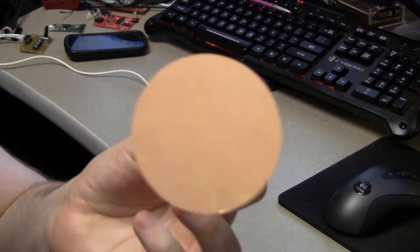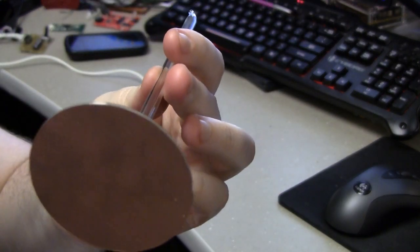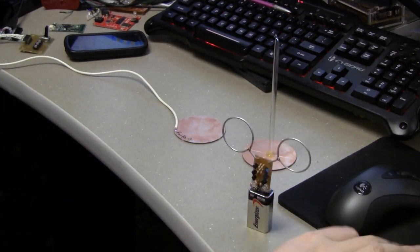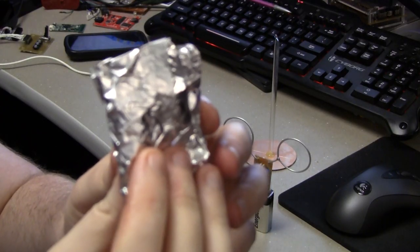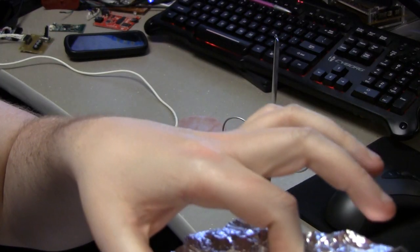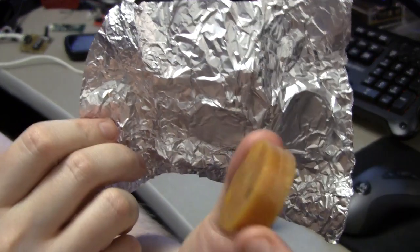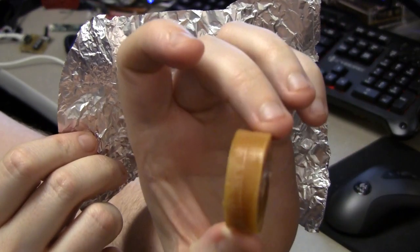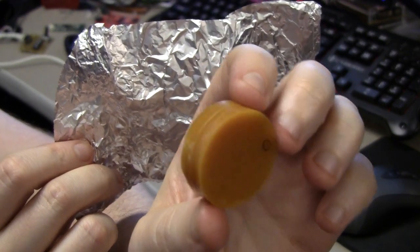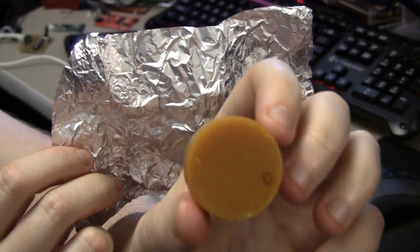Here we have a piece of wax material, double-sided, glued to a piece of glass — this is basically an old-fashioned electrophorus. We have another one here that I've earthed. I'm going to take the electret material that we made earlier. You can see it's just a brown-looking waxy thing — not a particularly good moulding job, there's some shrinkage. But this froze in an electric field of about 10,000 volts per centimetre, so it's got quite a strong electric charge embedded in it.